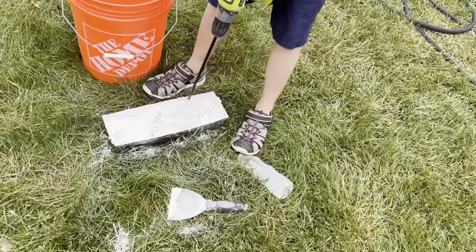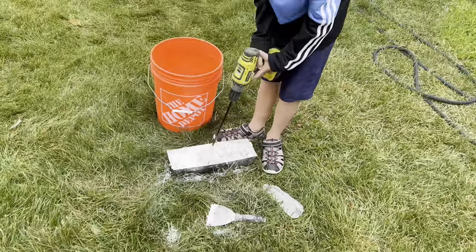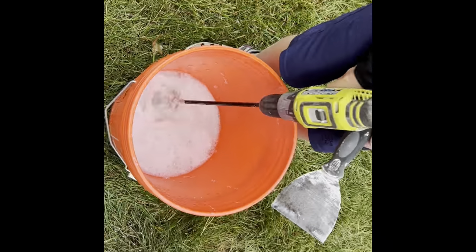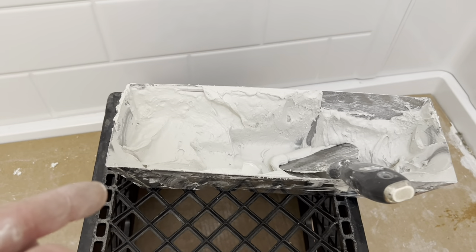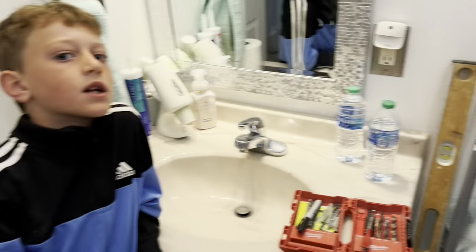A lot of guys don't like mixing this bag mud. I bought a little five-dollar paint mixer and we're just mixing it up outside in the yard - don't worry, it won't hurt the lawn. The gap is filled with Easy Sand 90. One of the biggest complaints is people don't like using bag mud because you always have something to throw away - but it'll be hard in 90 minutes so it's gone. Don't focus on what you're throwing away, focus on the time you saved not hanging drywall. Now we have 90 minutes to wait, and while that's going on we're going to start installing the shower door.